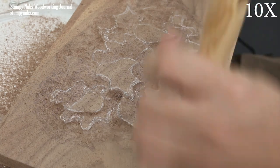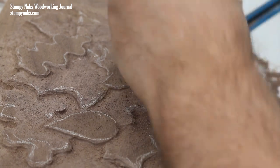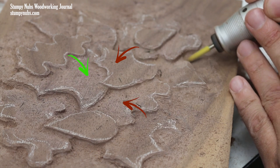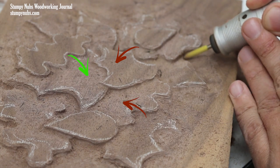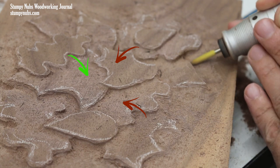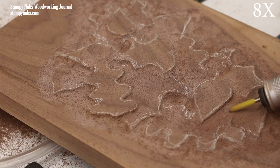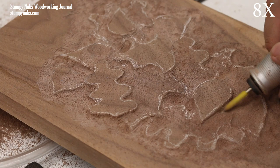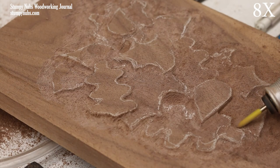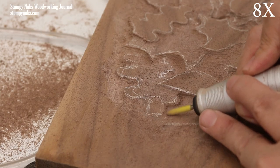This type of partial layering is the key to creating a carving with depth and realism. I add a few more leaves and begin outlining them. Periodically I pause and use a pencil to redefine the edges so I can keep track of what's overlapping what. We're still just roughing things out at this point, trying to define the different layers. Note how the small maple leaf appears to set on top of the larger maple leaf, and both look like they're on top of the oak leaf, as if they were three separate layers of the carving.